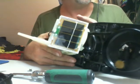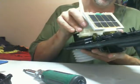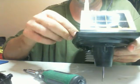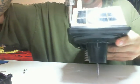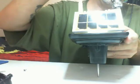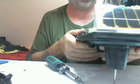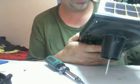Now the two screws are mounted back into the sensor. As you can see, it's going to kind of float there because of the weight — there's a brass ingot inside to keep it weighted down. Now we're going to move the radio assembly back up into position and put the two screws back in. As I said before, with the Davis they're a nice system — they may be a little bit pricey, but they last a long time, and if something breaks they're easy to repair. All the parts are modular, so instead of replacing an entire instrument cluster you're just replacing the part that broke. We're going to clip the ribbon cable back into place.